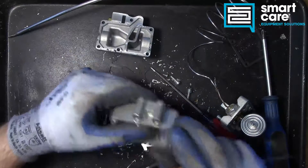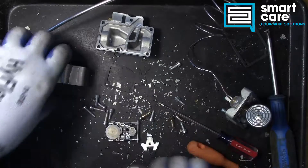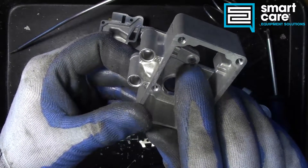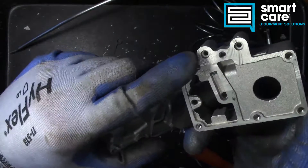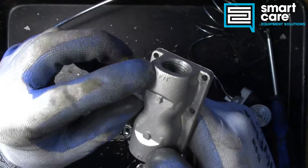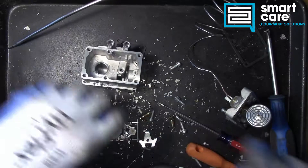Bypass is probably the same way — in fact it may even be an identical screw, and it looks the same to me. The bypass on this fitting brings in gas from the body of the valve, feeds it over into this bore, and our tapered brass needle controls flow through this hole, which then flows back into this passage leading to the outlet. So it is literally a bypass — it just dumps gas around the thermostat assembly.